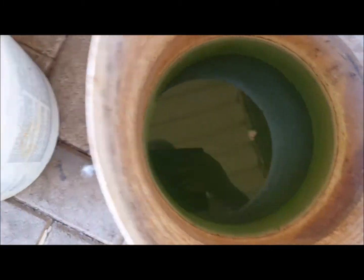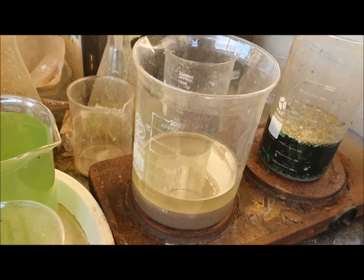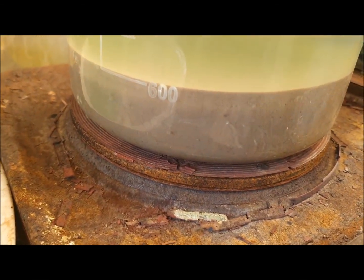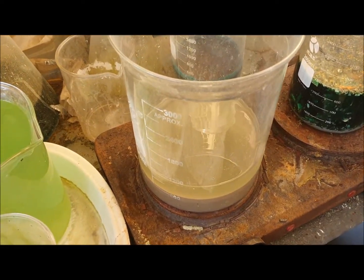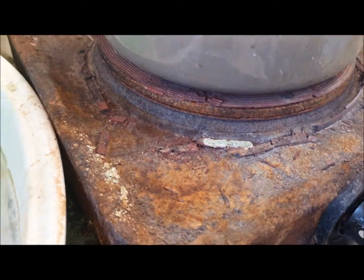Well, I've removed most of the green liquid — there it is there. This looks a little green but it's clear; you can see the stuff in the bottom. I've been rinsing it and I'm going to keep rinsing it just to try and get rid of this green. I'll pour that into here and show you what I'm left with. The sediment has all settled and I've been pouring the solution off. Now that looks like a lot of solution but it's not all precious metal unfortunately — there's a lot of copper in there, in a finely divided state. When I processed stock pot two last time, I put the copper back into stock pot one, and this is what hasn't dissolved. So there's precious metals amongst that.